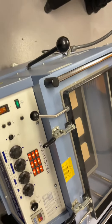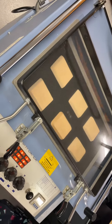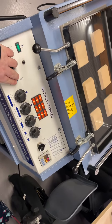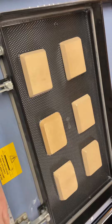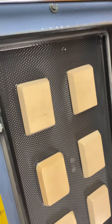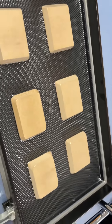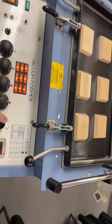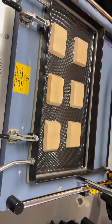Pull the lever back and then raise the platen into that piece of plastic. I'm then going to add the suction. That will then remove all the air from our vacuum former sheet. Once we've done that, I'm just going to blow a little tiny bit of air in just to release those moulds.